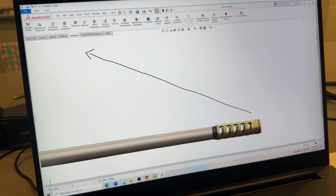So I came up with the idea of, okay, let's stop trying to focus on reducing the amount of blast, or working with a horizontal blast design, which I was at the time. The idea was increase the blast as much as possible, make the performance as crazy as possible, just direct the blast away from the shooter so that particles of stuff isn't blowing in your face for one, and then two, you aren't getting the blast and the concussion either. So what I settled with and came up with was direct the blast up and over your head, so that it wasn't coming in your face, but it was still there, and then at the same time it was combating muzzle rise.